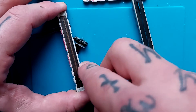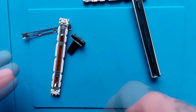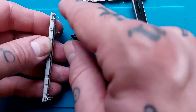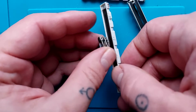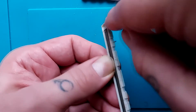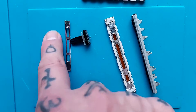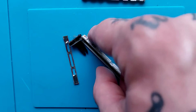If the brushes snap you can feel it's really rough in there — it can actually scrape the conductive strips on the little circuit board inside. I've also seen it where the metal from the input or output pins corrodes if there's been enough liquid, so there's no electrical continuity between the pins and the strips. If you open it and can clean it, great. But if there's scratching, wear, or rust at the tips, the fader is usually no good. They don't seem to be made anymore, so you'll need a donor if the brushes are broken or the base is corroded.